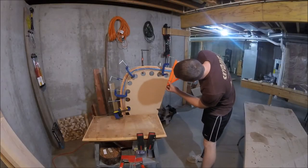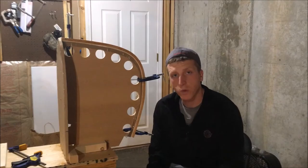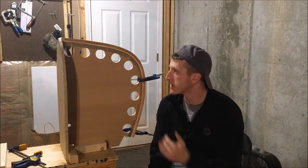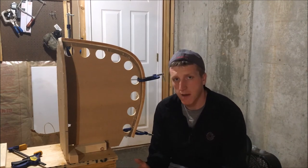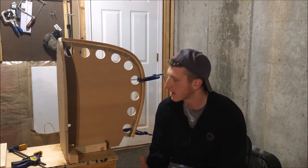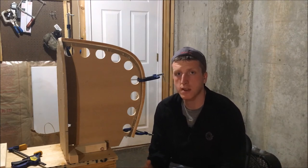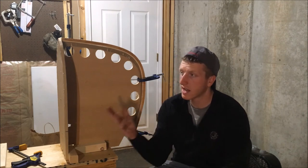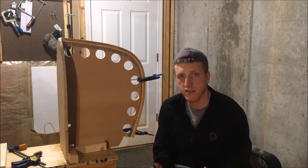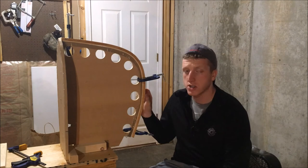After 24 hours, I mark the appropriate ends of my inside stem and cut them to size. I've steam bent and glued up the stems, and I've attached the inner stem here to the stem mold. According to Canoecraft, you would steam bend and glue up the stems, then set up all your station molds, and then come back to the stem to shape it. So consider this a break in the video — I'm going to go ahead and shape up these stems.